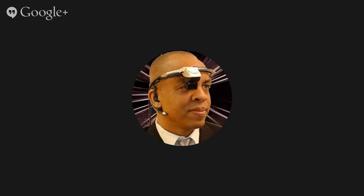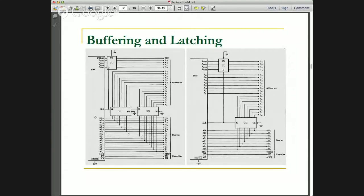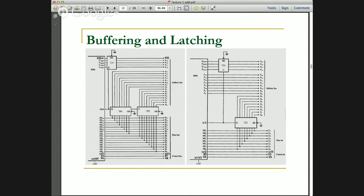That chip will be activated, and the pinouts from the AD lines then become an address line, right? So if you move to the right, you'll see the data bus is your D0 through D7, and your address line would be from A0 to A19, or is it 20? Again, this is how the multiplexing works between the address lines and the data lines.